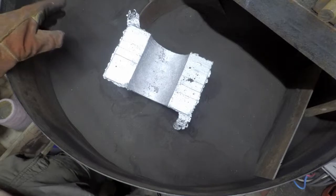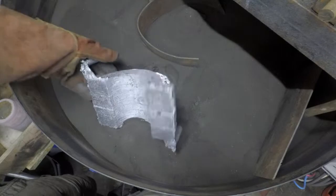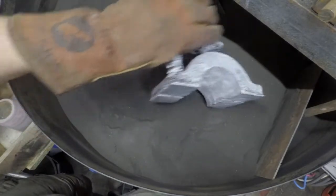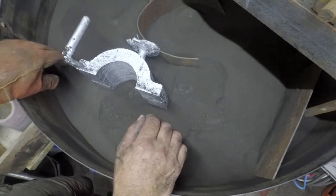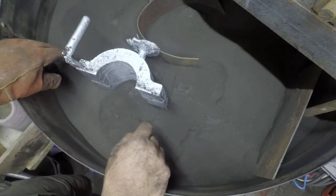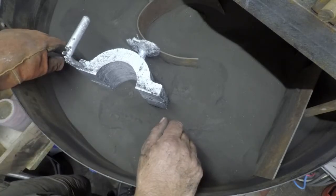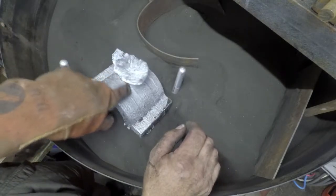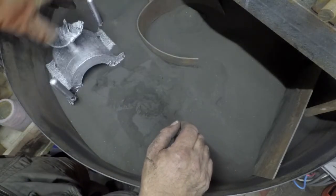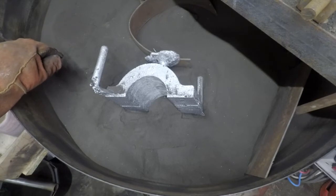Obviously it will need some machine attention, but if I can do another one of those tomorrow, then I'll have two halves that I can clamp together, dump a lump of clay in the middle and have a hammer-in plug, and then I can put the clay in and pound it. We've got a slight dip around the sprue though — oh, look at that.